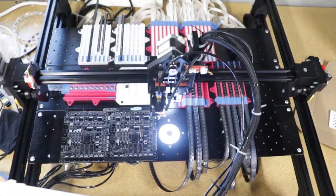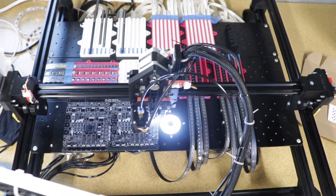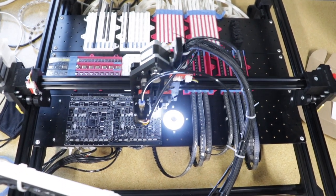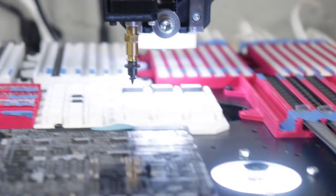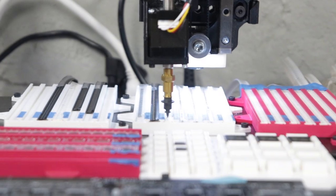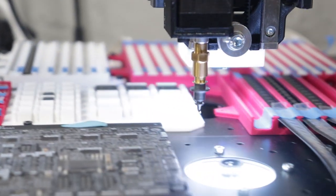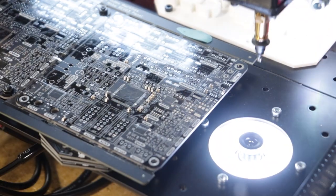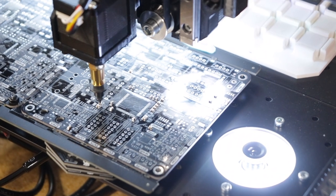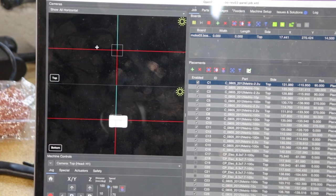This is such a good trick, and it helps so much getting your configuration dialed in before you're ready to commit to actually populating boards for useful work and getting it to reflow. I spent a bunch of time getting all of the feeders configured, the part heights and sizes and vision pipelines all calibrated, getting fiducial homing set up, getting the automatic nozzle exchange working — pretty much everything tuned and calibrated to the point where I could hit run and it would go through and populate a board with minimal intervention.